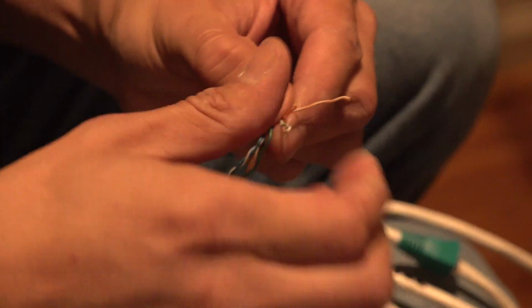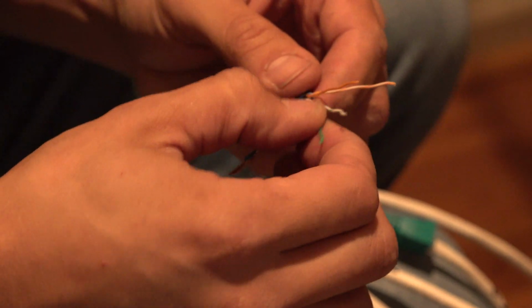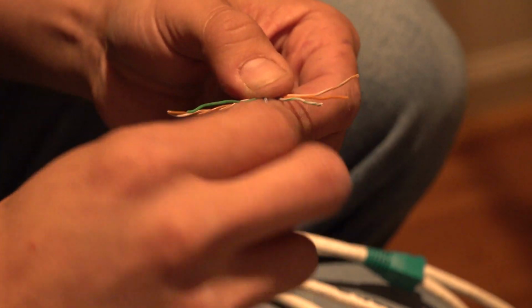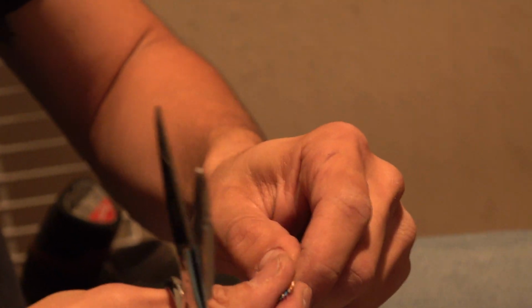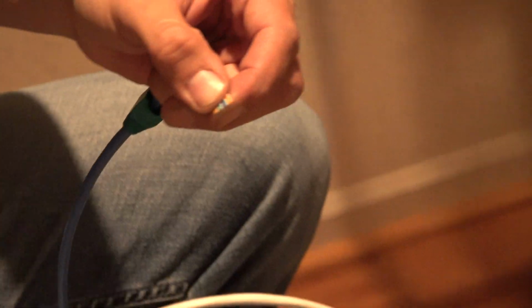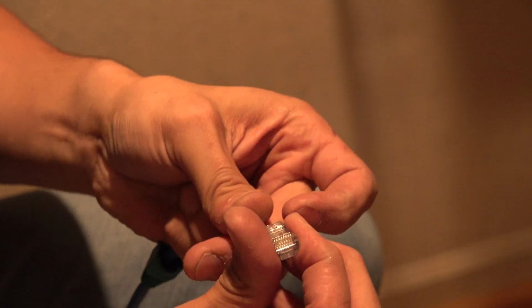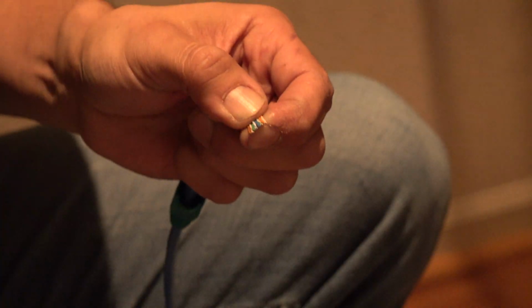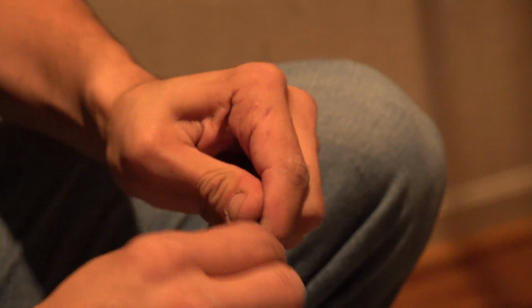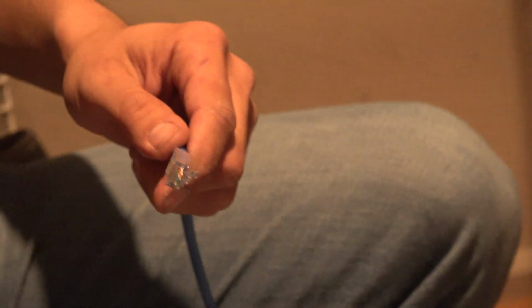Well, what's the difference between the Cat6 versus the Cat5? I think it's the thickness of the copper. You can really tell in this one. If you get a Cat5, it's really flimsy. So Cat6 is for higher bandwidth and longer distance then, right? Right. And you've got your shielded, double shielded, especially if you're running a lot of Cat6 or Cat5 near electrical. You want to have it shielded, because otherwise it'll cause interference to the camera. Do you have to have the shielded terminators too? Yeah, especially if it's going into a big cabinet, like a big board or switchboard.